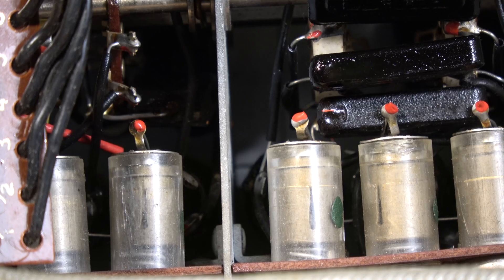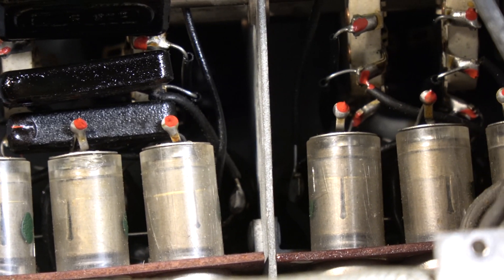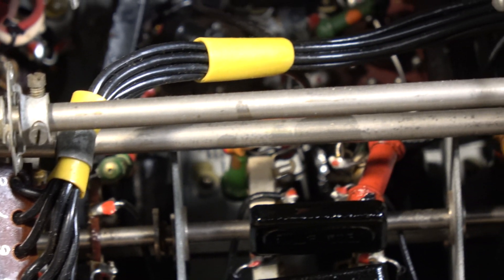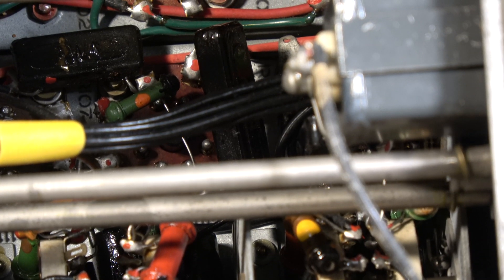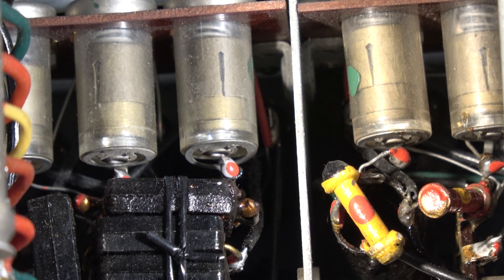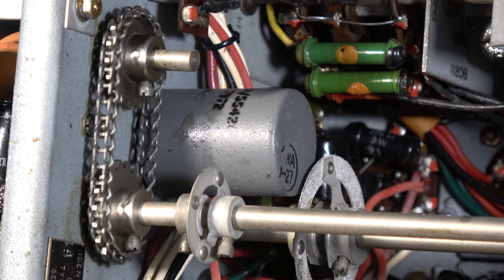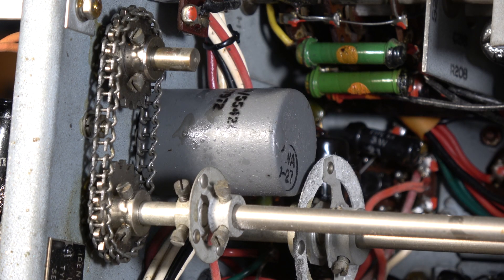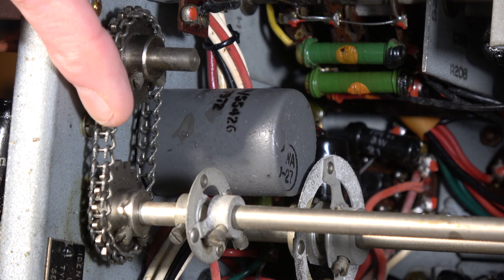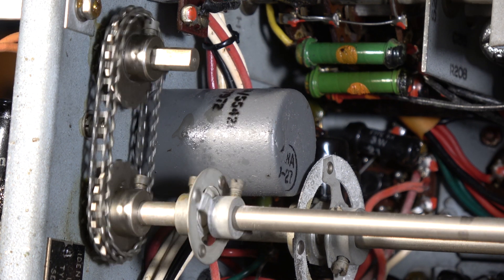The IF stages and audio are separate from the RF side. There's a 6J5 driving headphones through a transformer. Depending on the pins used on the connectors, the filament heaters can either be wired up for 12 or 24 volts in a series-parallel arrangement. The HT is 250 volts. The volume control is connected to a long shaft to a chain drive, which drives two potentiometers — one for AF gain when using it in RT, and one for RF gain in the CW mode.